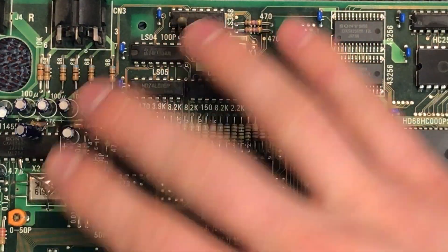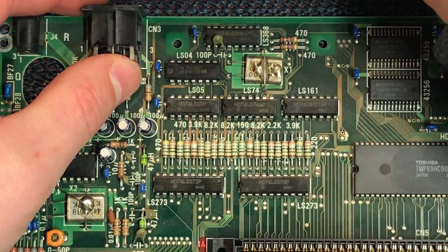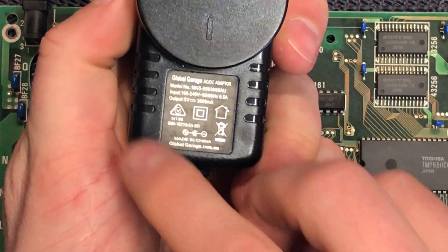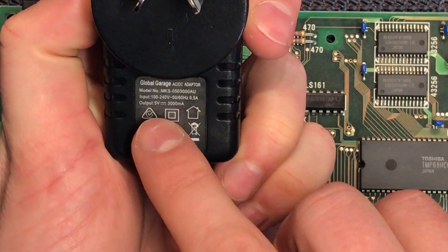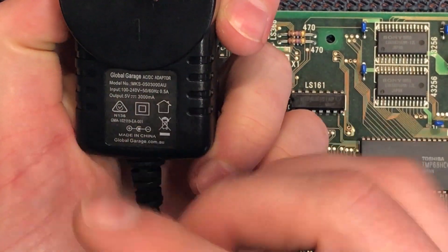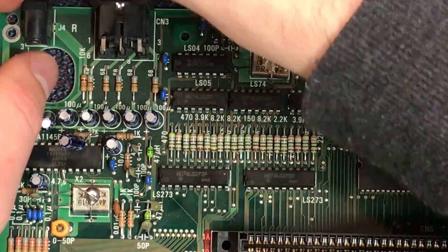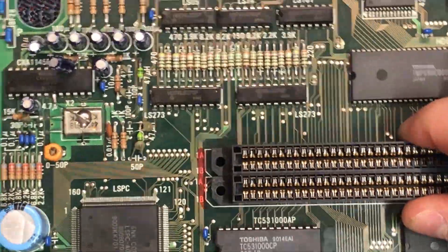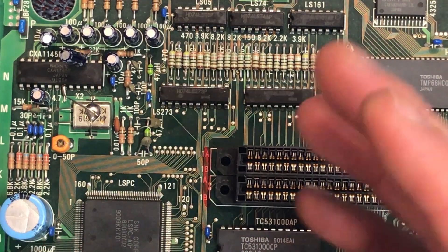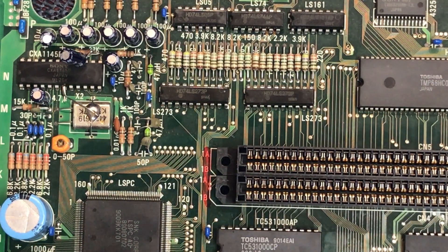There are some things we need to fix up - that upgrade is probably for another day. But let's get on with it and power this thing up. It's very important with these early revisions: you only feed it 5 volts, a nice regulated 5 volts DC. This supply can provide up to 3,000 milliamps - 3 amps - so that's absolutely perfect for this board. Most later revisions use 9 to 10 volts and have regulators on board to drop that down to 5 and steady it out.